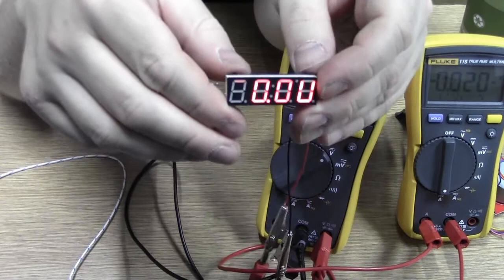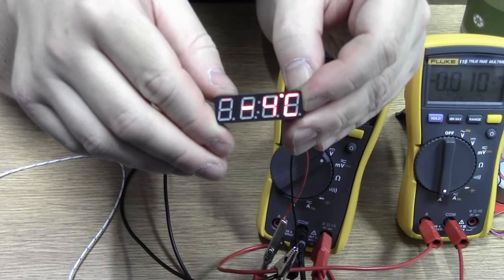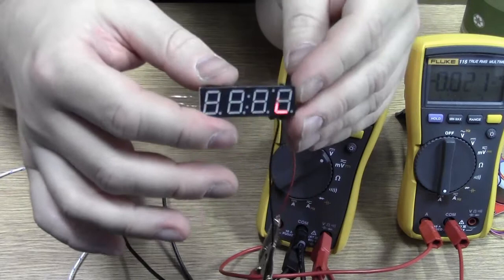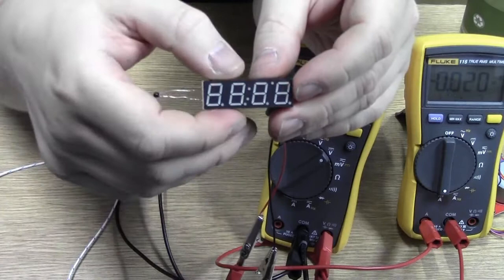Next one along. What we got? Temperature. Yeah. Temperature accuracy. Temperature position adjustment. Minus 5. Plus 5, let's see, minus 3, minus 4, 5, yeah, right, well that's definitely that, so you can adjust the temperature reading by a few degrees if your thermistor is out slightly or the readings are out, only much use if you do have something accurate to test it against, so you can test it against a known sample, set this to say 1 degree higher, so it measures everything 1 degree higher and all that sort of stuff. Yeah, so a little bit of calibration there, I imagine, for voltage and time.